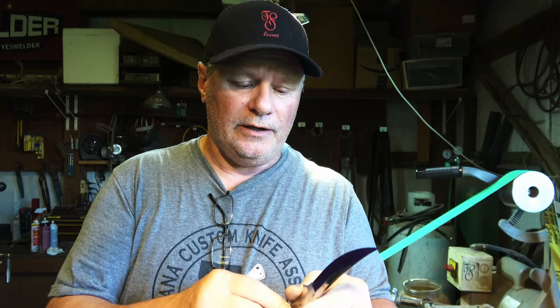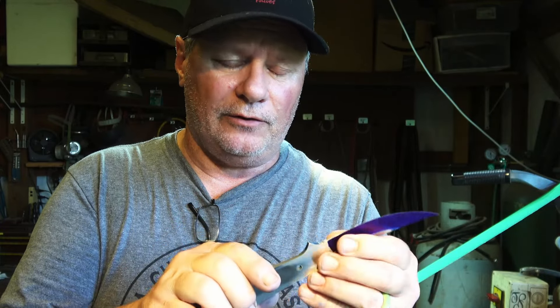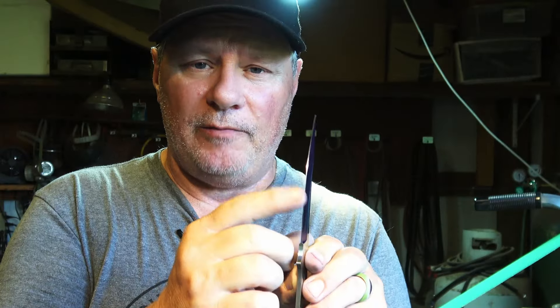Some people use a waterfall platen, but you can't do that on a hollow ground knife — the platen is flat and this is hollow, so that's not going to fly here. I'll use the J-Flex belt, overlap the wheel, let it come in here and cut that radius. I'm down to about 30 thousandths on my edge. I'm going to get down around 15 to 20 thousandths, and then we'll go to our next step, which is finishing these blades.